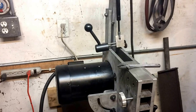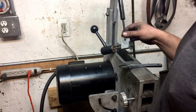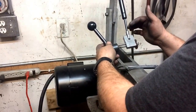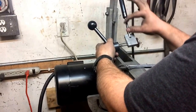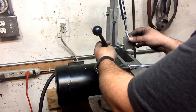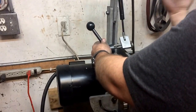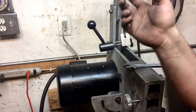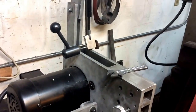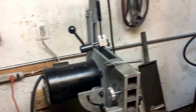Right now I actually prefer it on the motor side — there are fewer things to interfere with and hit your knuckles on, although it would work on the other side with a slight change of angle. The spring can travel a couple inches in and out, and that's where your tension is ultimately gained from. The way this locks into place is that it goes over center, so gravity pushes it down and keeps it from falling back on you.